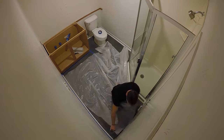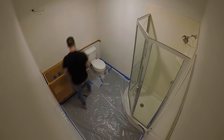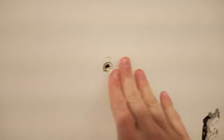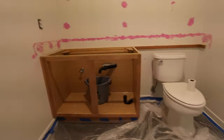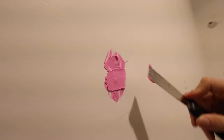Since we would not be touching the concrete floor and we would not be replacing the toilet or the shower, I covered those with plastic. Now it was time to start repairing any damaged wall. For this, I used a pink spackle — this stuff is really great because you know it's dry when it turns white. After it's dry, just use some sandpaper and knock it down so that it's flat with the wall. Sometimes you might need to also add some spray-on texture.